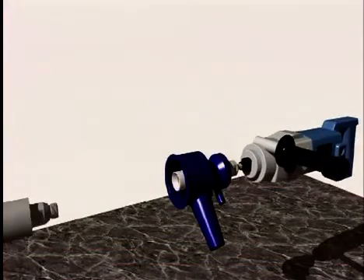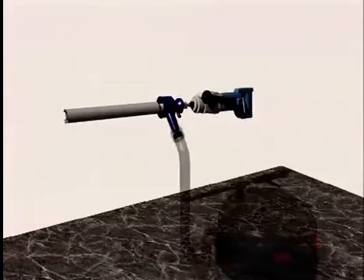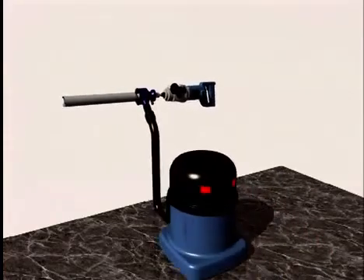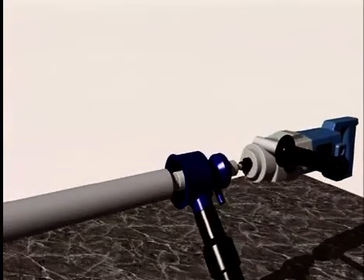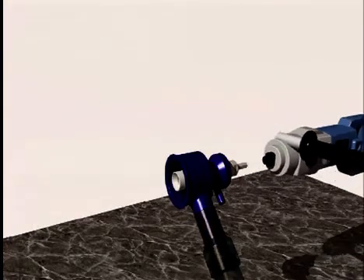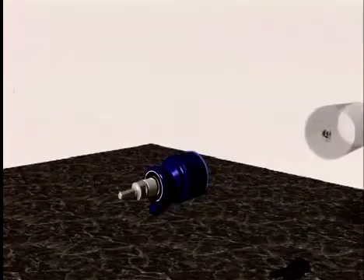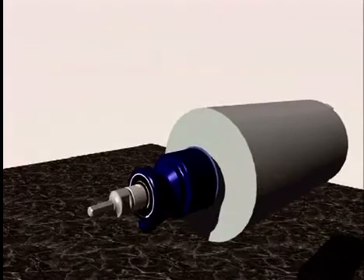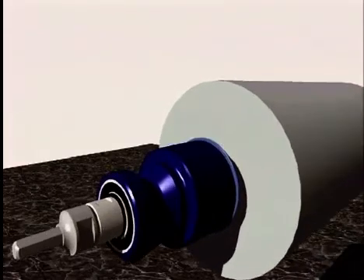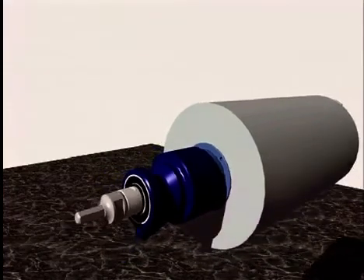Let's take a look at dry drilling. Using the lower end of the size range, the attached vacuum draws dust down through the inside of the core bit into the multi-swivel dry chamber, which importantly isolates it from the drive shaft bearings and seals, thereby increasing the working life of the unit. Working with larger diameter cores, the unique design of multi-swivel enables a sleeve to be drawn forward to enclose the rear exit apertures of the larger core bit, creating a highly efficient vortex for faster dust extraction.